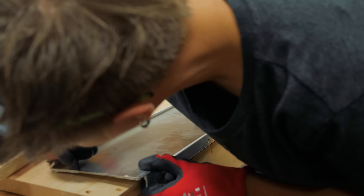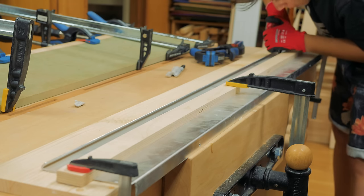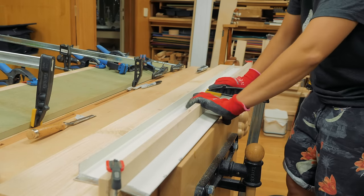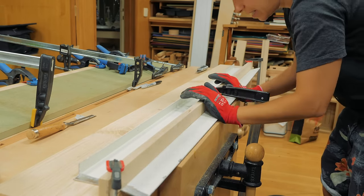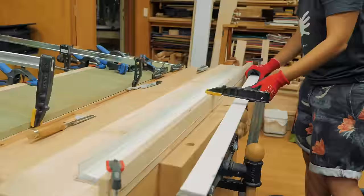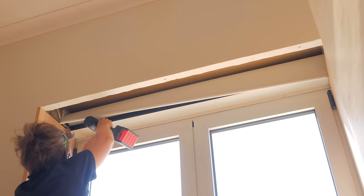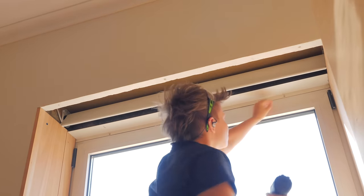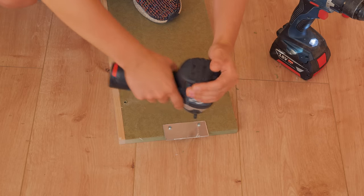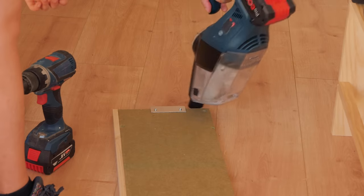For the top section, I reutilized part of the aluminum cover for the area closer to the window. Since I moved the roller closer to the glass, I had to cut this piece and thought I could get away with just an X-Acto knife, but I was wrong — it took a couple of passes with the angle grinder until it finally snapped. I reattached the piece with two screws and used the old front section to find the correct placement for holes on the new water-resistant MDF cover. I added a tab on each end to keep it from falling when set in place, and using thicker MDF allows me to have the screw heads below the surface for a flush finish.